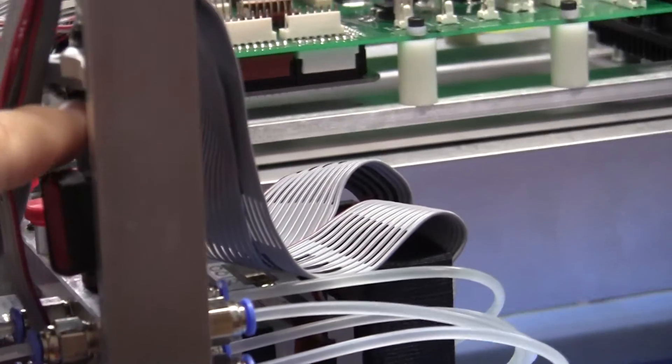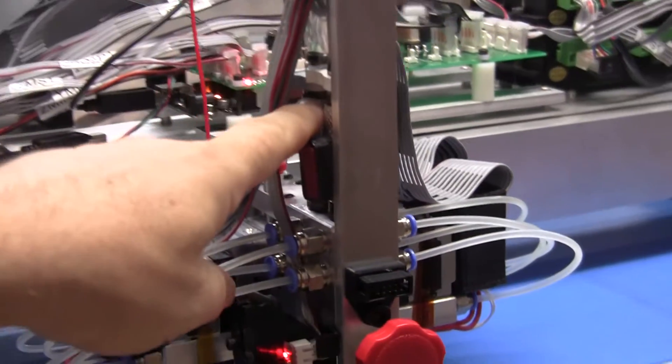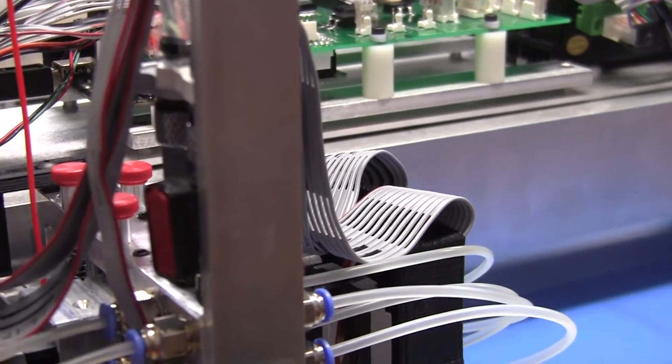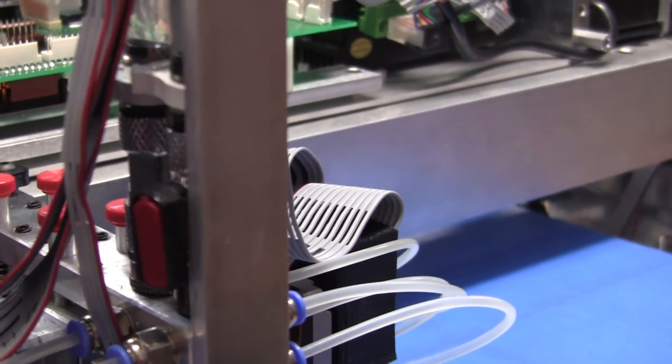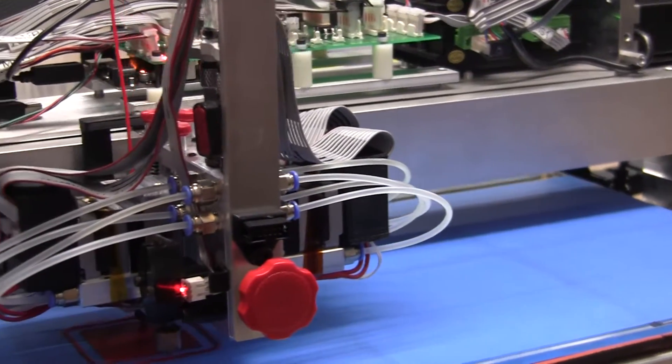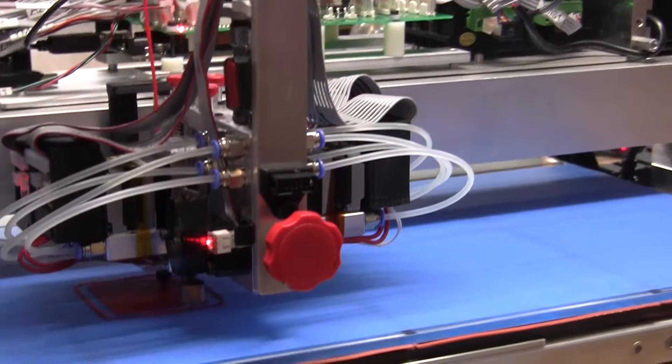So when we first put the machine together, we discovered the O-ring that was supposed to be right there wasn't there. O-rings are important — that's the challenge. The vendor shipped this barb fitting without an O-ring and we didn't notice that. And the consequence? It leaked.